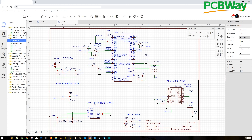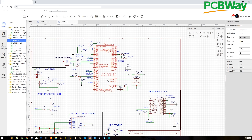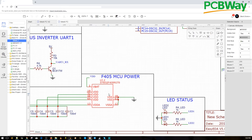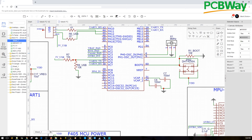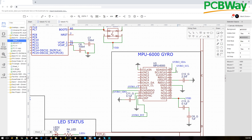Let's get started. The key components we mentioned were the 3.3V regulator, the MPU-6000 gyro, the 8 MHz resonator, and the USB. Starting with the resonator in the schematic — here's the 8 MHz resonator that we saw on every F4 and F7 flight controller board. The microcontroller unit is drawn in two pieces to make the schematic cleaner, separating the power section from the inputs and outputs. The 8 MHz resonator connects to pins 5 and 6 of the MCU, as shown in the datasheet.